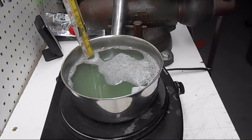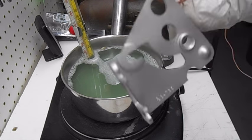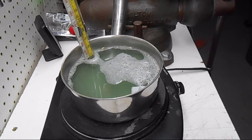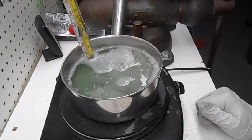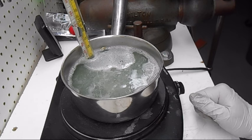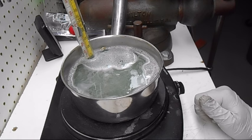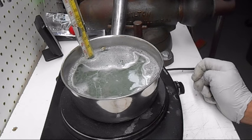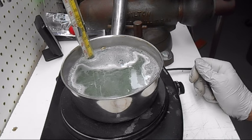I've put the solution from the jug into the pot and got the temperature up to close to 200. I've got this choke pull-off bracket off a Rochester — I've bead blasted and cleaned it all up. We're going to throw it in the solution. You can see we're starting to get a reaction from it. Usually these small parts, screws and stuff, I usually leave them in for 10 to 15 minutes depending, and we'll come back and check it out.